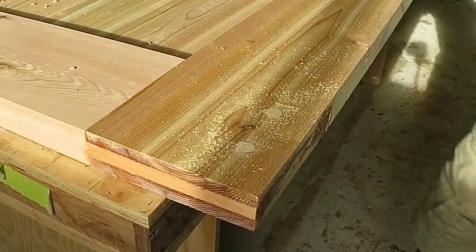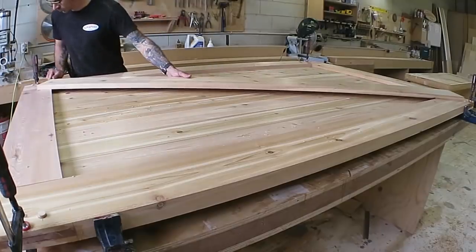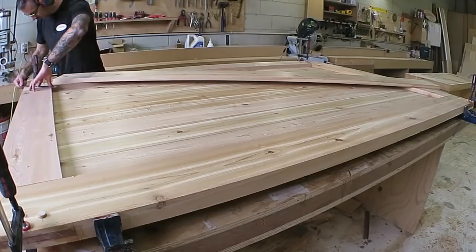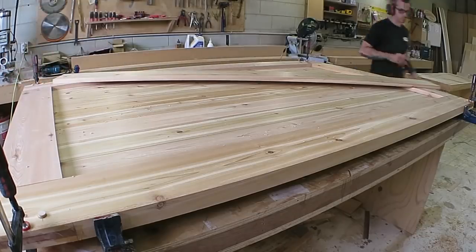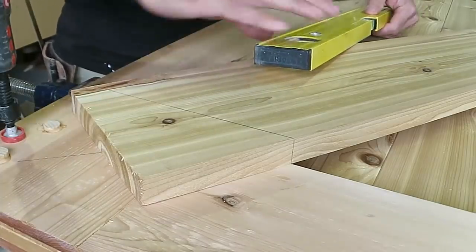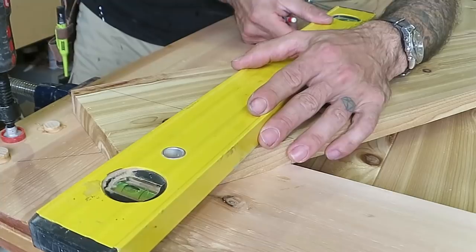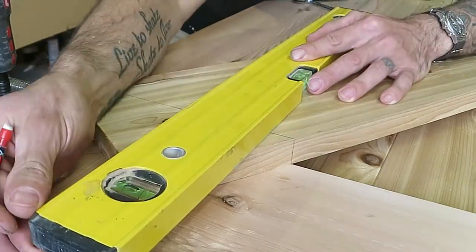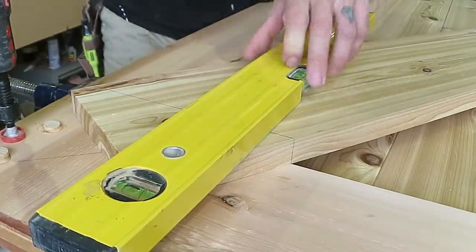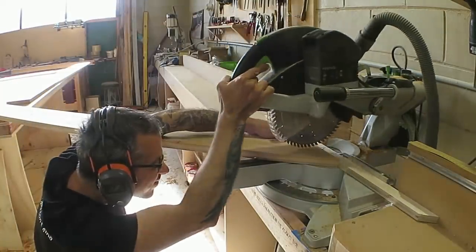So the main focus of this door is a large X brace right through the middle of the door, which the clients really wanted. That's the whole point about making this door. And it's not doing anything at all, which is another cool thing about barn doors, is that the bracing is kind of null and void, and so you can do any shape you like and not have to worry about any kind of particular joinery. You just fit the pieces in to where they need to go.